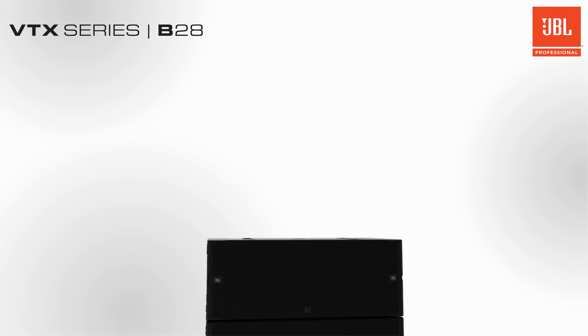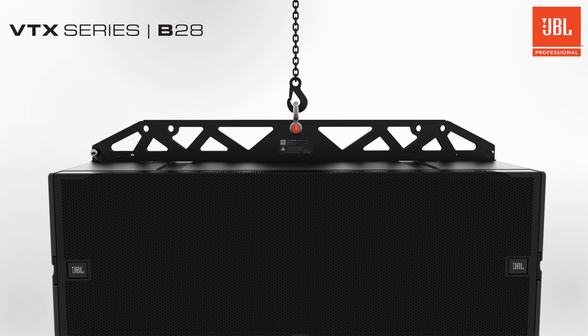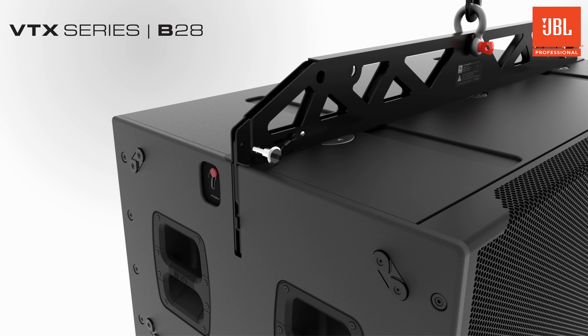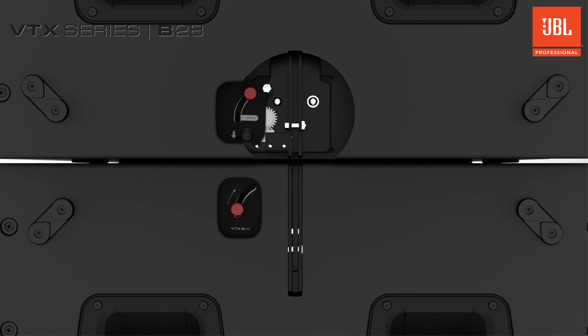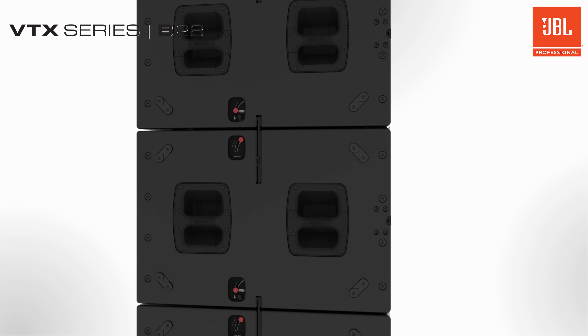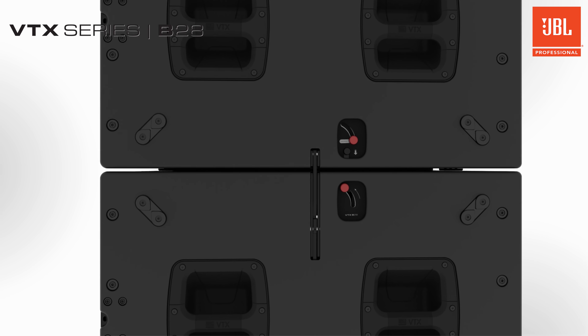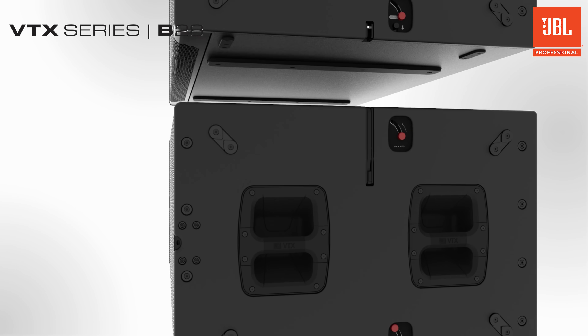The new rigging design makes flying cabinets simpler than ever before. Arrays are hung from the suspension bar which connects to the onboard two-point rigging and supports single-point or dual-point suspension. With no loose pins or parts and captive link bars, connecting two cabinets is as easy as releasing the spring-loaded link bar and securing the cabinets together with the locking lever. Each subwoofer has two interconnection points making suspension fast and smooth. Cabinets are quickly disconnected by pressing down the safety knob and lifting the lock lever to release the lock. The link bar can then be slid back down into the bottom cabinet where it will auto-lock in the storage position.